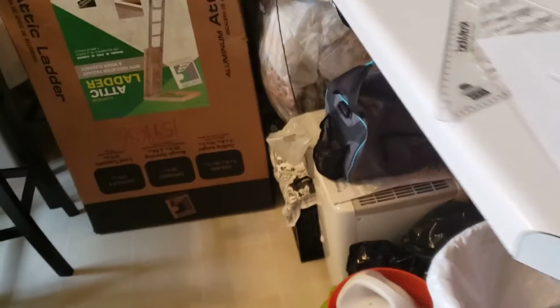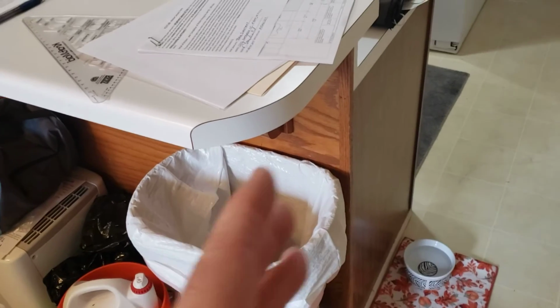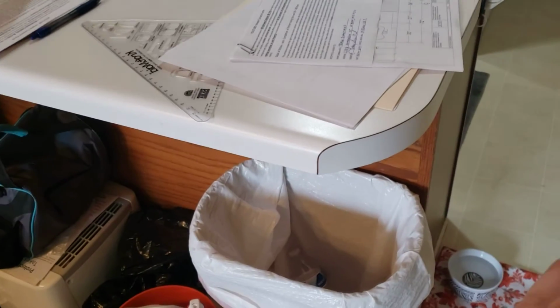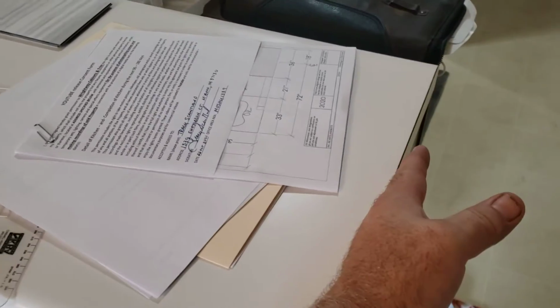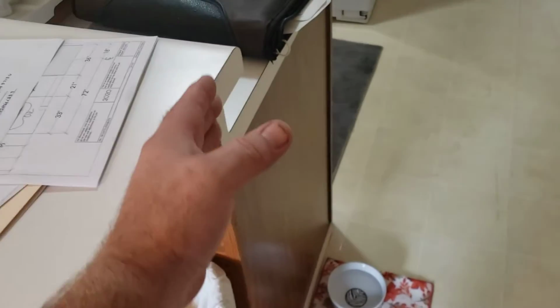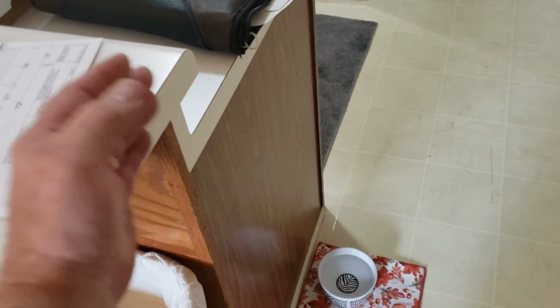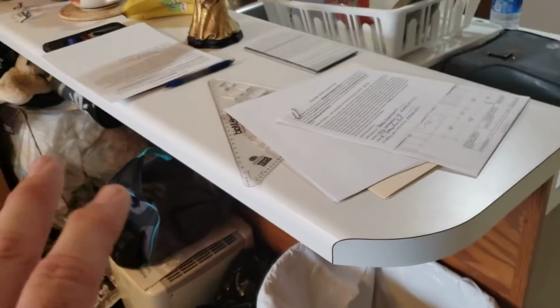Now that being said too, 89.25 inches is what this length is now. If you want, you can actually go to 90 inches. That's only going to be a 3/4 inch longer than what you have now because this upper bar right now is actually out at least that far, as far as the transition from the bar to the other height right here. So you can go 90 inches with this one without a problem if that makes your math better as far as laying out the cabinets on the back.